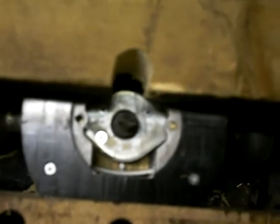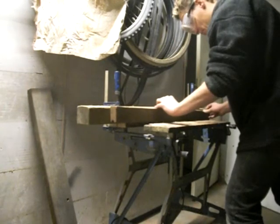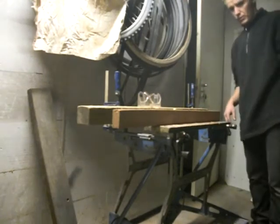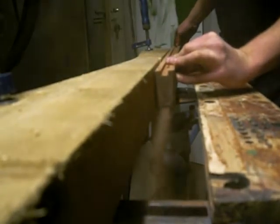Basically what I've done is just put my router in my workmate and make sure it's flat, then clamp this board here with a little cut-out for those really small cuts I have to make. Super easy setup. And there we are — a bit of sanding to smooth it. Looks straight-ish. And that's the routed centre board.